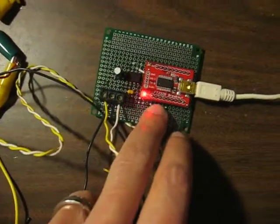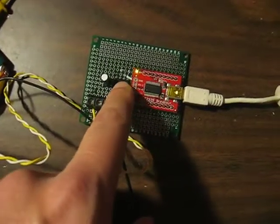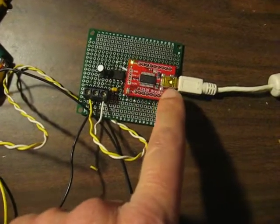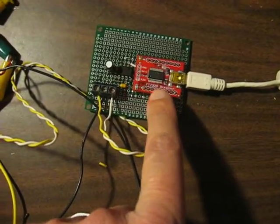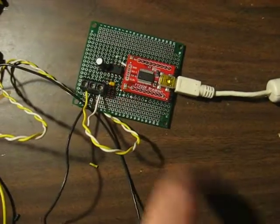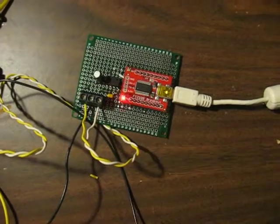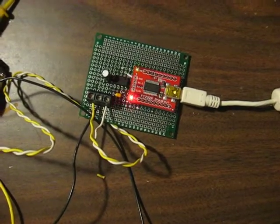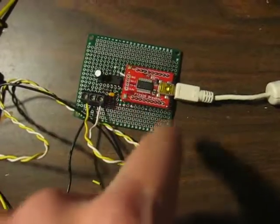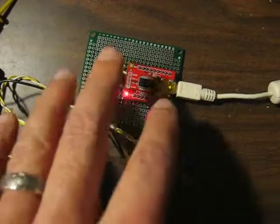that is a server interface module. So here we have an RS-485 talking to a SparkFun USB to TTL serial interface chip, all mounted on Eddie Wright of WrightHobbies.net's fine prototyping board. This is a cool little board. It allowed me to not make a printed circuit board for this and still have a complex setup.